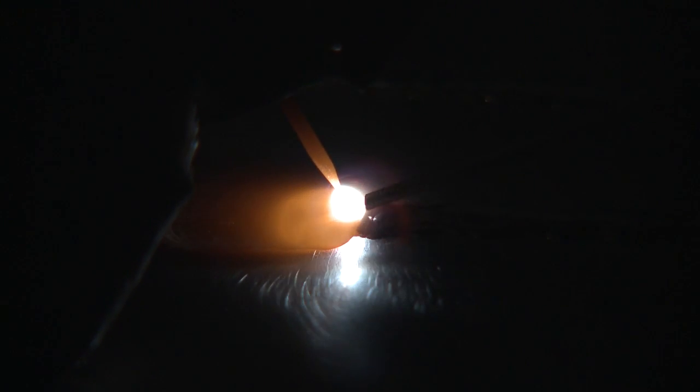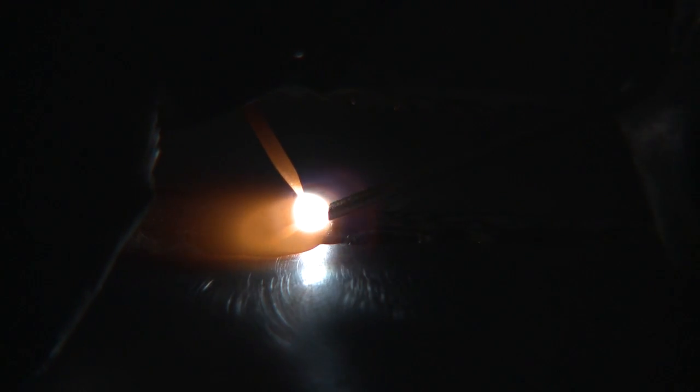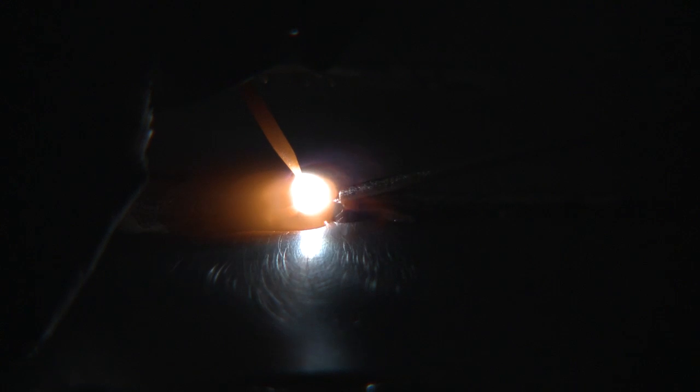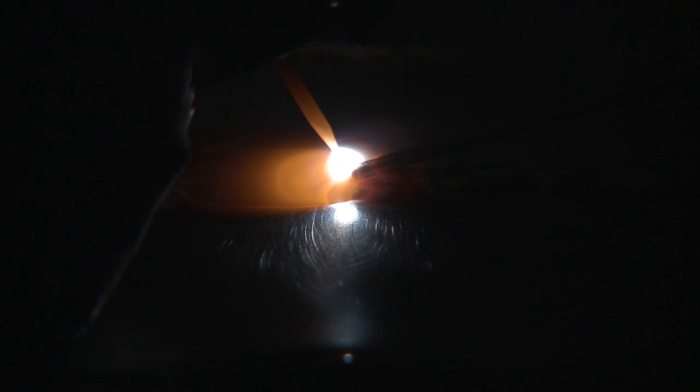Notice he's got just a little oscillation going, and that's because he's got just a small amount of gap in that weld joint — want to make sure he catches both sides, didn't want to overrun the weld. You can see the dab, dab — just really good repetition. That's a 24-inch long weld. It takes a lot of stamina to do that.